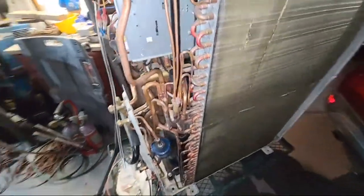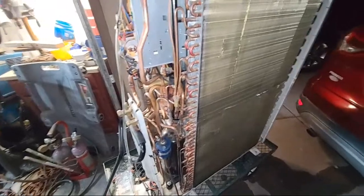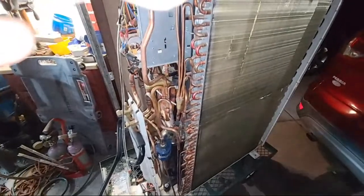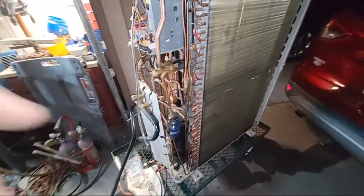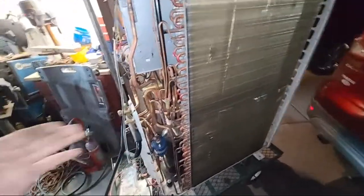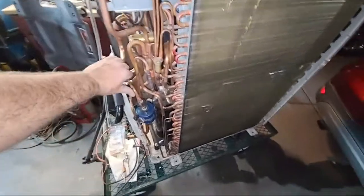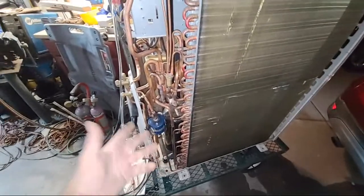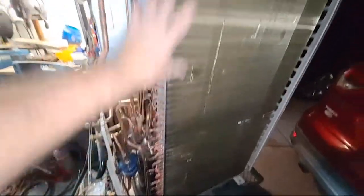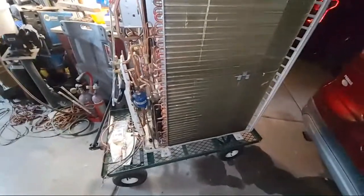I'll have to make my own controller to work those two EEVs, adding a couple more thermistors — quite a few came out of the unit, like one or two around each expansion valve. I should be able to put one thermistor on here because this will be a common suction line when it's in heating mode, to get the leaving suction temperature. The other one will be right on the feeders or stuffed in the coil — clamped on one of these. Target five degrees superheat across the coil, just like what walk-in cooler EEVs have been doing for 20-something years.